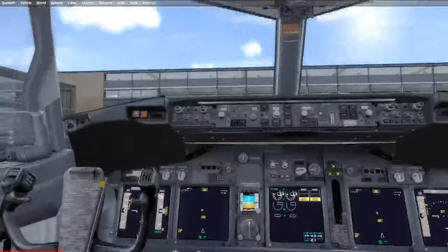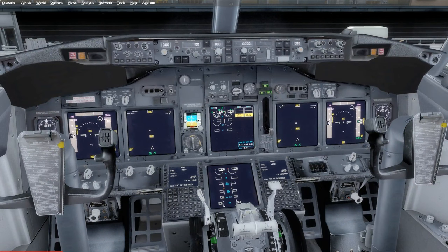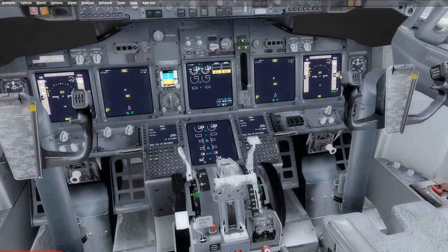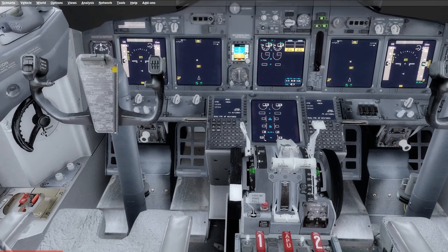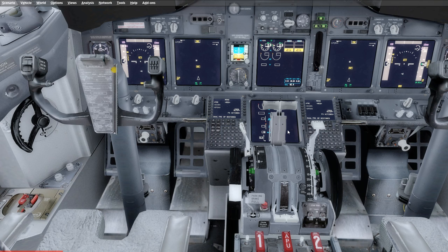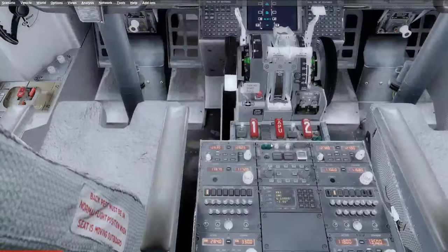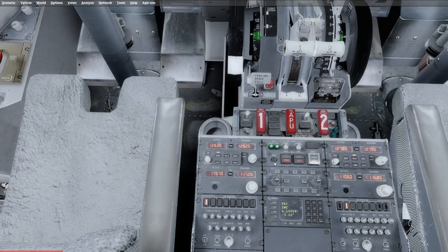Now we can fall down here and look at our flap position and our flap indicator — they should be in agreement. If they're not, there is a fault with the flaps, as the airplane is fully powered up and the electric pumps are now working. We're then going to move our throttles forward to check that the takeoff configuration warning system works; moving the throttles forward you will see a takeoff config warning, and in some airplanes a takeoff config light will illuminate on both sides of the forward panel. After that we can go ahead and do our cargo fire warning test, making sure the discharge light illuminates both fire warnings and the green extinguisher lights.